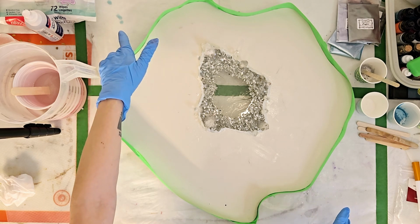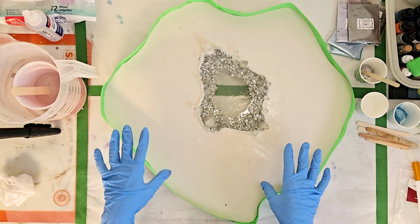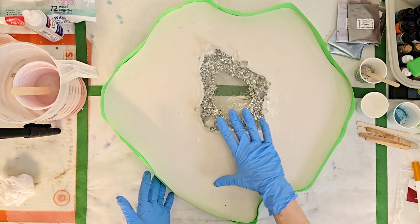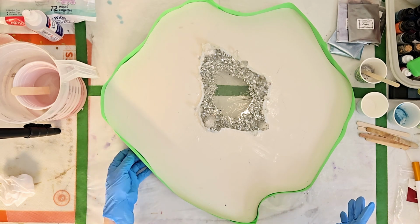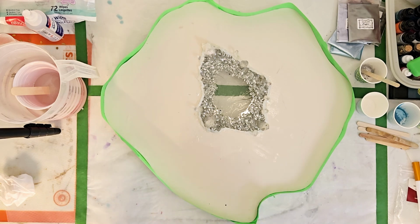So we don't want our epoxy spilling over right away. We want it to set up and get thick before we pull this off. That way you're not going to have that whole top layer flood over. We're only going to have a little bit, and that's going to be great because I'll cover up the 1/2 inch of just white that's showing on the sides. And they'll be nice and clean, and we won't have a whole bunch of extra epoxy underneath, which I never taped because they'll just be a pain when I have to go sand it. So yeah, that is where we are. And that is my explanation for that.